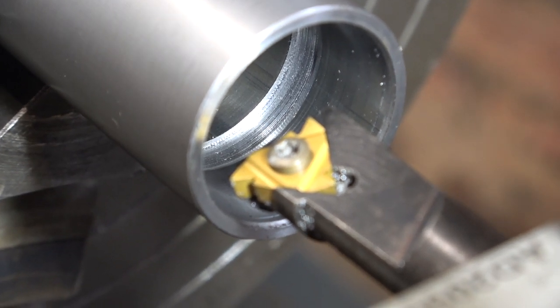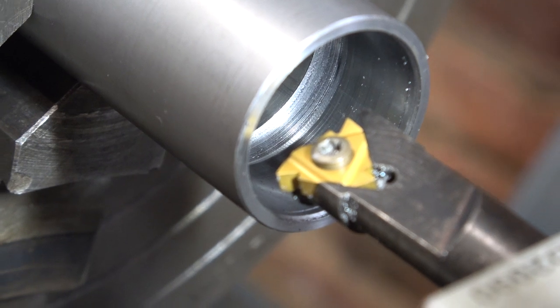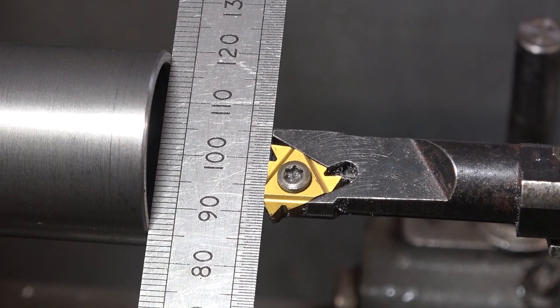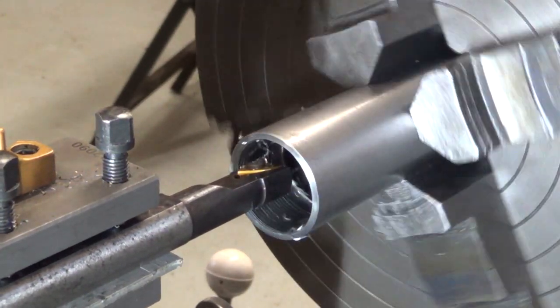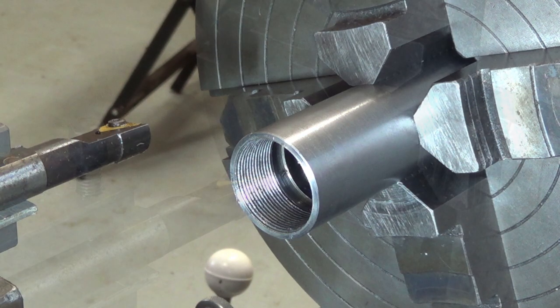I've machined the relief about 6mm wide and 1mm deep. I've also fitted a 60-degree screw cutting carbide tip and checked that the tool is square to the work. Because I'm cutting an imperial thread on a metric lathe, I have to be careful not to disengage the half nut — if I do, I'll never get back to my position. So I put my cut on, run the lathe forward, stop, back off the cut, reverse the tool out, apply my cut, run the lathe forward, and keep doing that sequence, making sure never to remove the half nut drive.